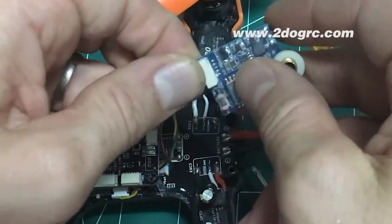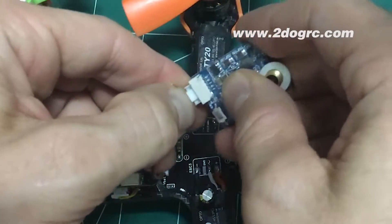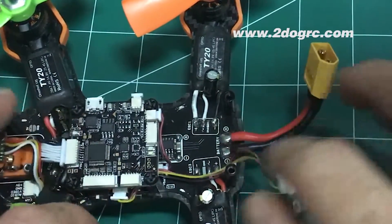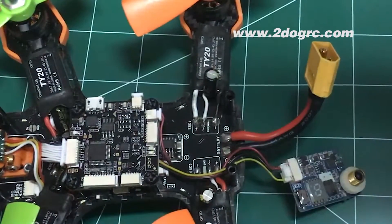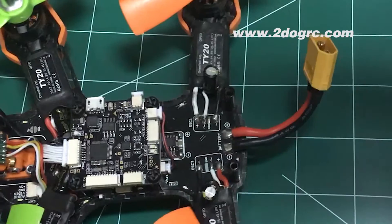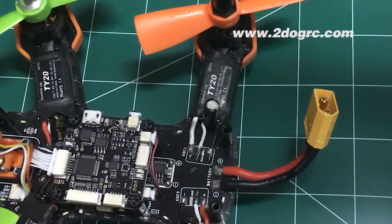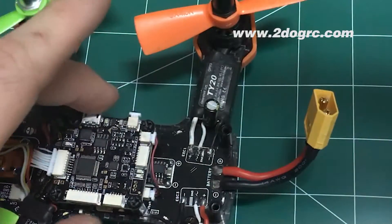Just for ease, I'm going to leave this plugged into the video transmitter and unplug this one from the board. Now, this won't really work on the 150 because it doesn't have a 12 volt regulator — this one's only got a 5 volt regulator, and you're probably not going to run 4S in this ship anyway. So just kind of disregard this, but it's basically the same principle.